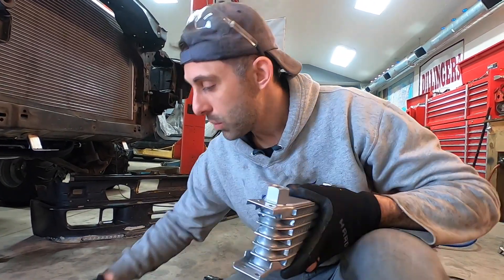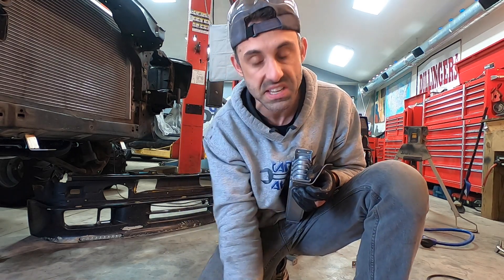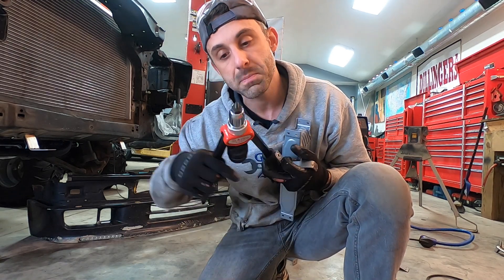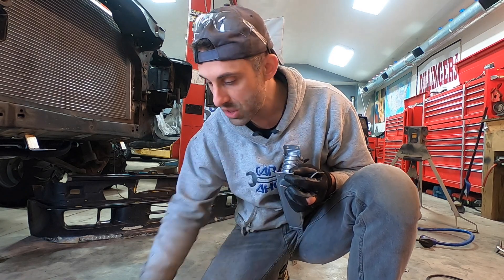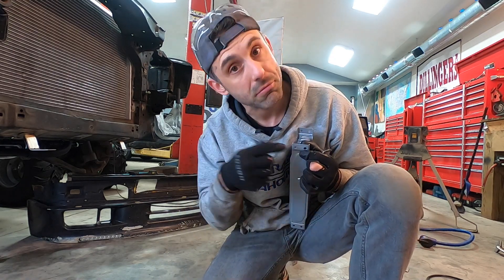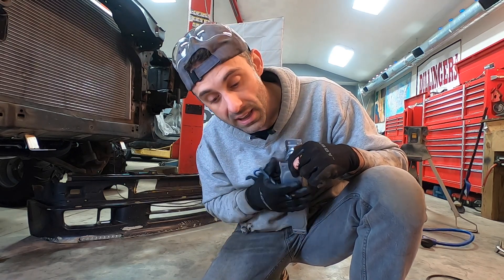To hard mount this, we're going to take the same brackets and make modifications. We're going to use rivet nuts — these are compressible rivet nuts. You use your rivet nut tool; this is an Astro 1427 tool. Basically you put the rivet nut in, drill out the holes just a tiny bit, put it in, then use the rivet nut tool to expand it. It crimps onto the aluminum sheet metal, and that way you can use any M6 bolt and screw it right on without having to hold a nut on the backside.